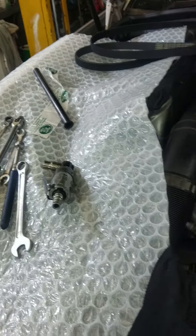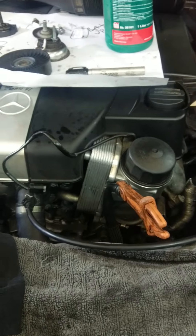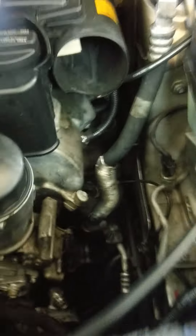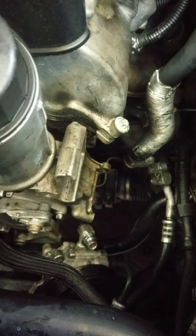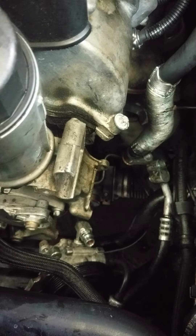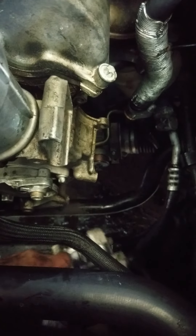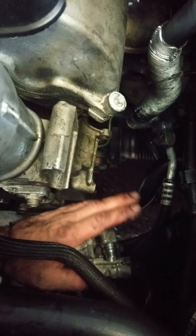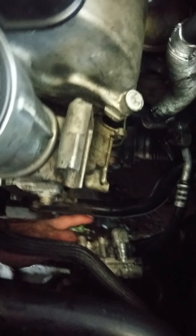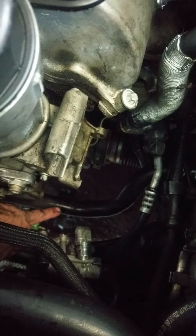Just a quick note on the 211E class — compressor failure. What this is about is jacking up the engine, not taking the bolts out of the engine mounts, not over-jacking the engine out to get the bottom bolt of the compressor clear of this wretched sway bar.